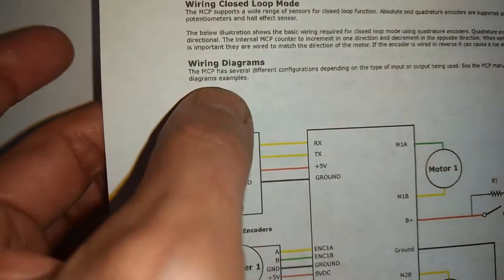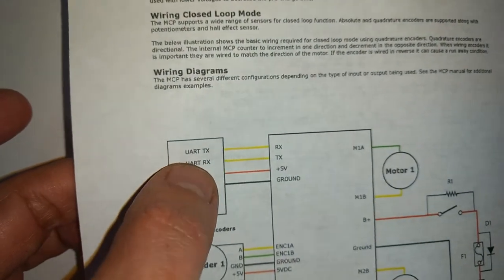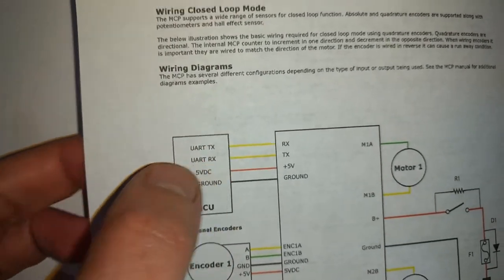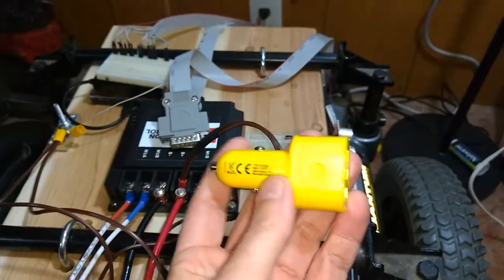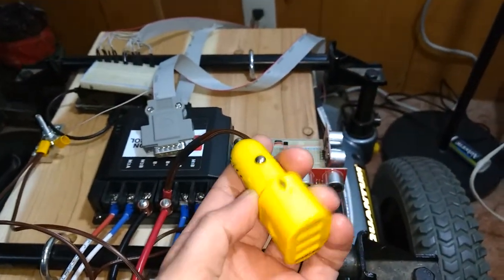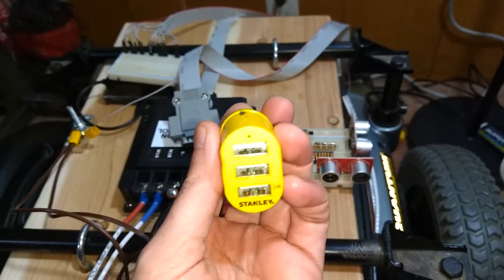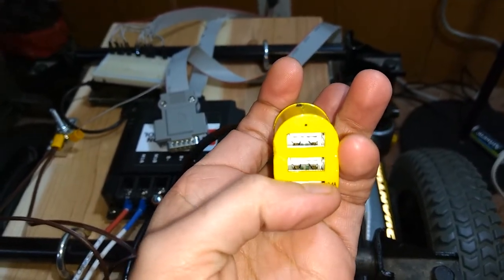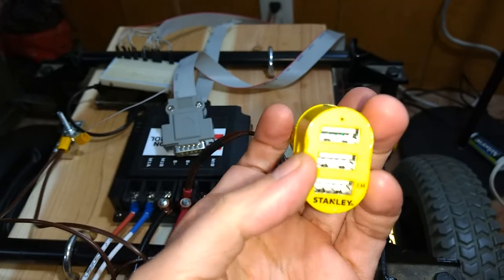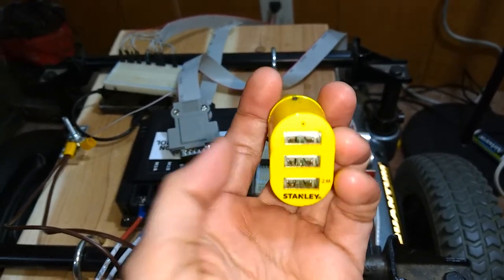And this is how I'm going to power the sensors that are going to be on this. The Raspberry Pi and the propeller are going to be connected through one of these, and I may have to get a separate one for each microcontroller. The Raspberry Pi will only be able to use the bottom port on this, and the propeller, I think I might do the same. Just run the 3.3 volts off of this to power the propeller.